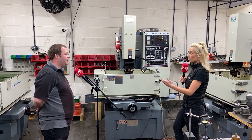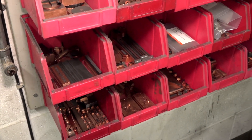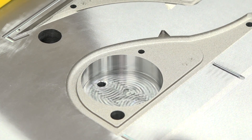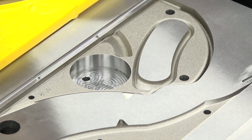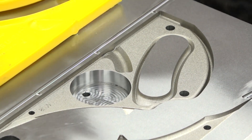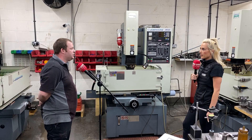How long does that take on the machine? It really does depend on the surface area. Some smaller electrodes take minutes, whereas this particular one I'm doing here is upwards of 15 hours. And how are you achieving that fine surface finish? Literally just by utilizing the fuzzy settings, or if needed for a specific application, we use the machining parameters that the machine allows you to adjust.